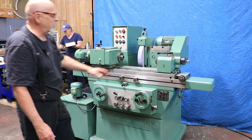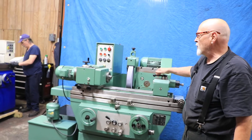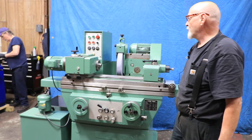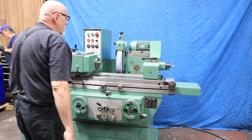Of course, we have a tailstock over here. This is a Morse taper number three. The tailstock center is a Morse taper number three, and the center in the headstock is a Morse taper number four. You also have a thread on the OD of this — it's an M48, that's a metric thread.